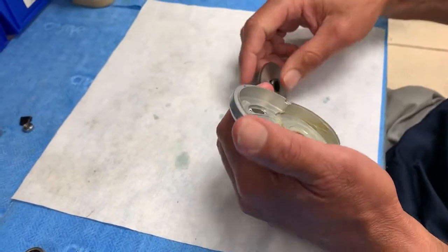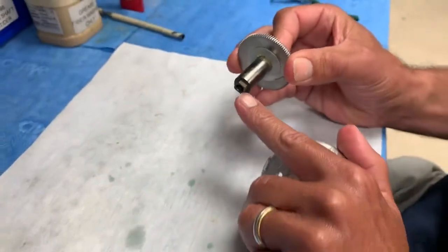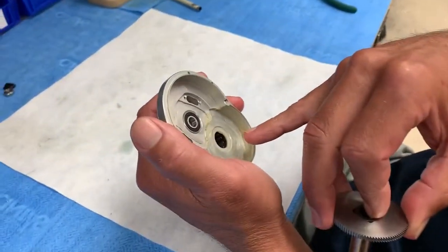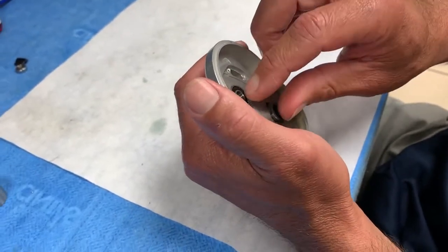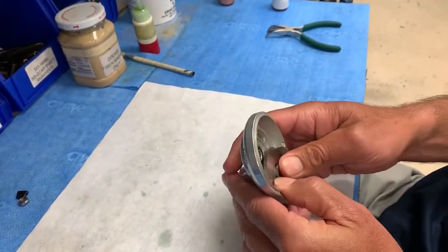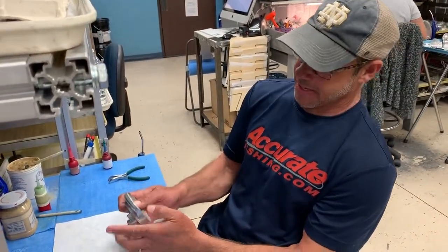Then we take our gear with our gear shaft. This gear shaft here — you can see it's all silver — and this part here is kind of a dark gray. That's because all this surface has been precision ground to about 5 tenths, which is 0.0005 inches. So that matches with the inside diameter of that bearing almost perfectly. When you insert this inside here, you can really feel that it's a match fit. It feels snug sometimes going in like that, but when you turn it, it's very easy to turn. It's a precision fit between the shaft, the bearing, and all these seals.